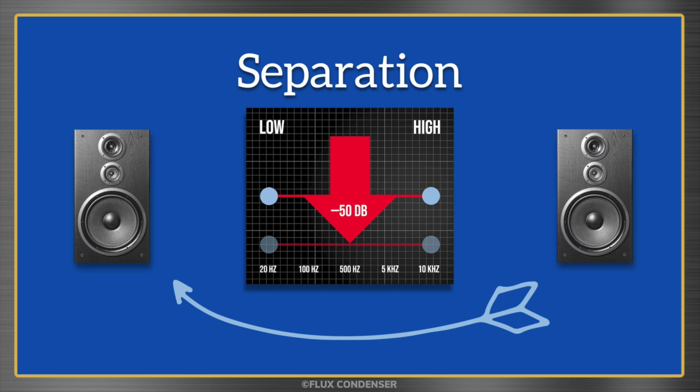At 50 dB, this blending or crosstalk is sometimes noticeable, but barely. Better equipment would provide better channel separation, which theoretically could enhance stereo imaging. But once again, after a certain point, the degree to which this makes an audible difference is up for debate.